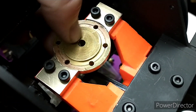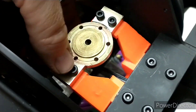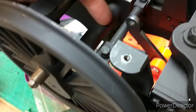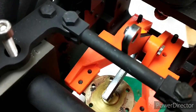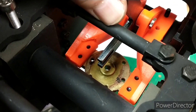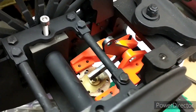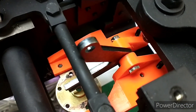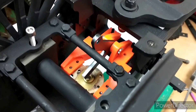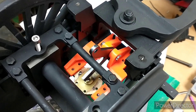I'm quite pleased with how this bracket has turned out, especially the silver soldering — we got just the right amount and it fits really nicely. You can see where the piston rod is going to come out and engage in the scotch crank — it should be about there, engaged, then move backwards. You can see the orange bracket is quite complex. Anyway, I hope you found that interesting — like, share, subscribe, please leave me a comment. Hope you enjoyed it and I'll see you in the next one.